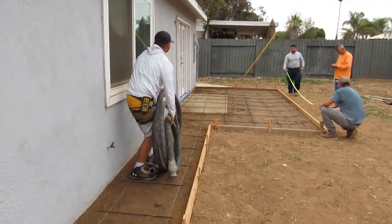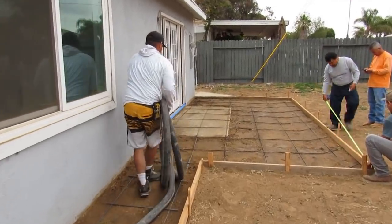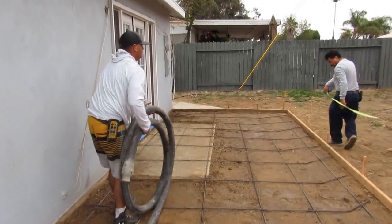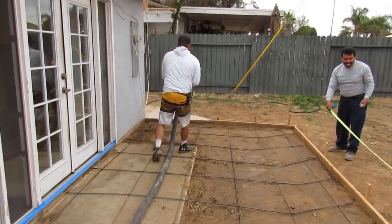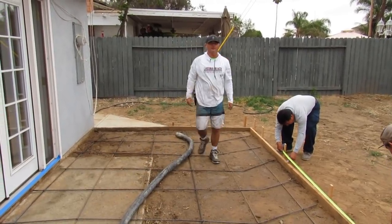I don't generally pump it wide open because it'll splash all over the house. I set the speed based on how much hose I have, how much air pressure I have on it, and what slump I'm doing — that's generally what speed I pump at. These guys are laying it out here. Javier brought out guys to finish this for my friend. They're just marking the joints prior to pouring.